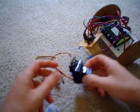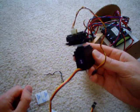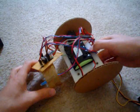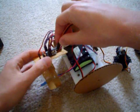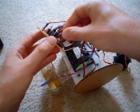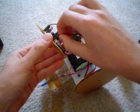This is pretty ghetto, but now you have an infrared rangefinder on your servo, mounted. Now you have your $50 robot. Yours probably does not look like this — it probably looks a lot better than mine. But we take the servo, we plug it in to the third digital output pin. Your microcontroller should have quite a few digital output pins.